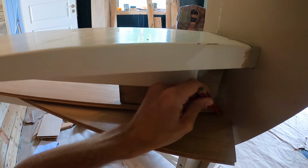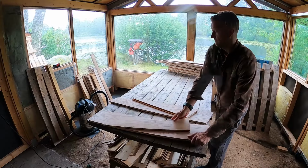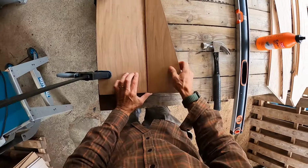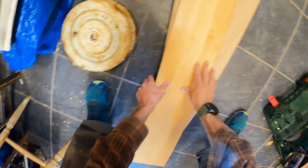In order to finish this step completely, I have to cut away the excess that sticks out on the back of the stairs, and then glue the two wooden floorboards I use per step together and put it under some pressure so it will stay straight.